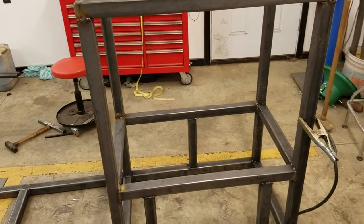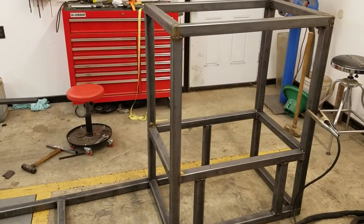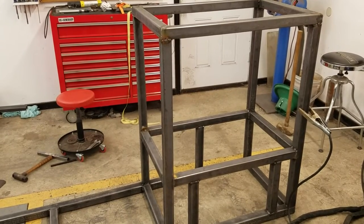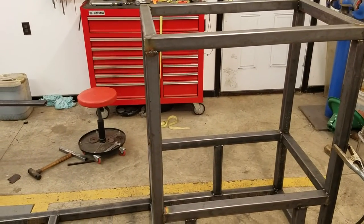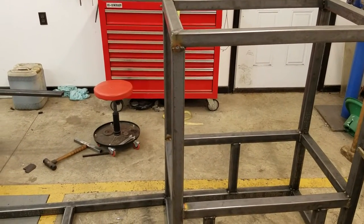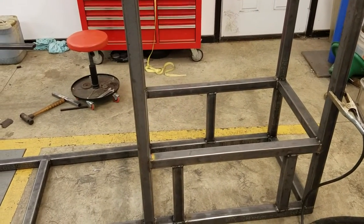That's the bottom portion of the smoke chamber, right above that vertical piece I have in the center. I'll try to get a picture of the CAD model I made of the smoker for my cut list next time, so I can show a little more detail of what's going on. I've been playing around with the TIG on a couple of these joints. Our MIG welder is just a small welder and it's not burning in as hot as it should for this 11-gauge — it's made for sheet metal. All the square tubing is 11 gauge, the sheeting inner and outer is going to be 11 gauge, with two-inch rigid insulation inside it, and we're going to have quarter-inch plate for the firebox.